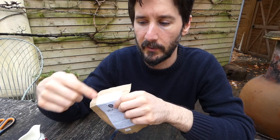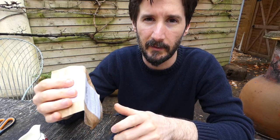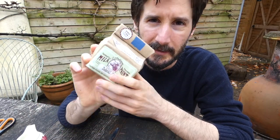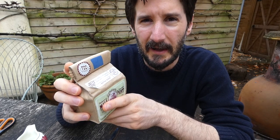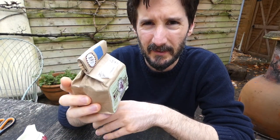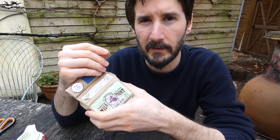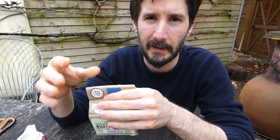I'll put links to both milk paint companies and to Alex's website in the description of the video, so check them all out — there's some really nice stuff going on there. Milk paint when it comes like this is in a powder, and it's a mixture of milk protein powder and then the pigment, whichever color you've got. So this one's blue — I've got red, green, white; it comes in any color you can think of. You just add water. The pigment is obviously for the color and the milk protein is what binds the paint to the wood, so if you were just using a dye — just the pigment — it would just wash off. The milk protein is the binding agent so it sticks to the wood.